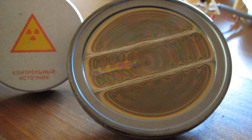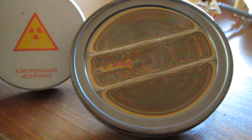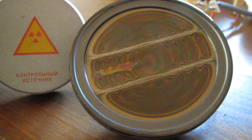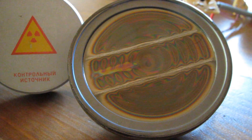On a detector that operates at a Geiger-Müller operating voltage, the charges — that is, the electrons — will cause an electron avalanche near the anode, so a large discharge involving many, many electrons, which creates one single large impulse. And if you have a see-through window, such as in this detector, that might give you very cool visual effects. So let's take a look.